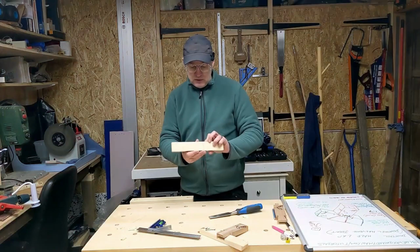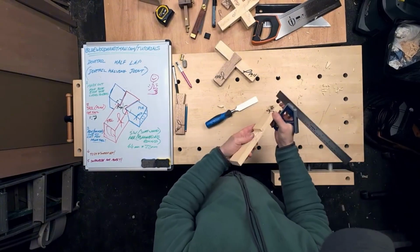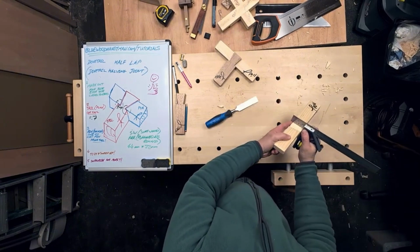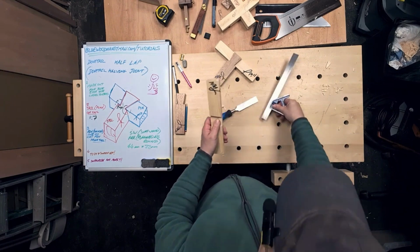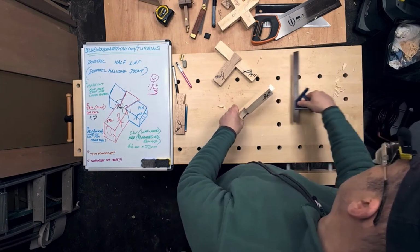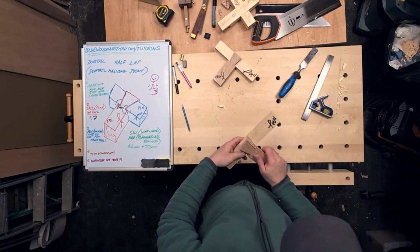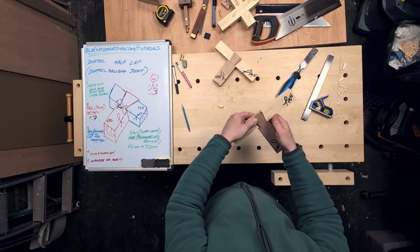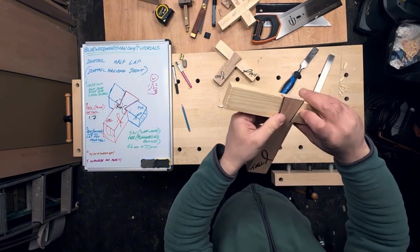At this stage, I'm going to check that timber now, and I'll take the combination square off of this edge. I put it down in here and see, are we getting our timber inside fairly square? If we are, that's good. Then this is an indicator of this is the time to see if we can offer this one up to it. So let's offer that up. And that's going in there, and that's worked in there nice and snug. So we have that there. Now we look very closely at that.